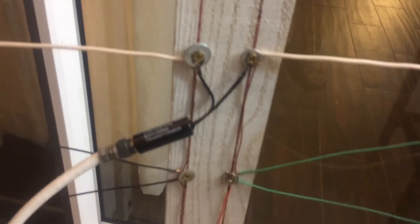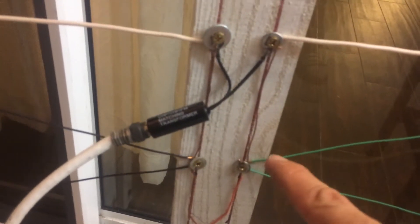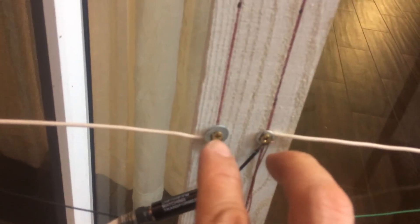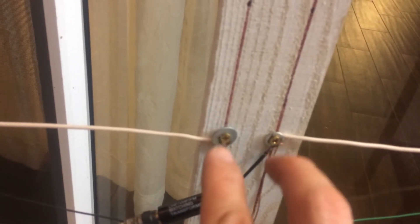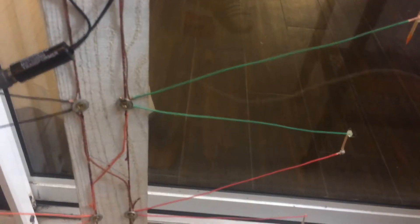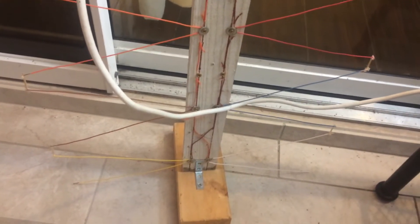Basically it's just an extension — I extended the legs up. This part here is four inches, and they're connected at the one and one-quarter-inch separation just like the rest. The extensions are 14 inches each in length. I used some toothpicks with hot glue to keep them in shape, because this wire is very thin — I think it's telephone wire or something like that.